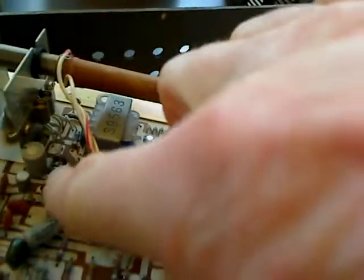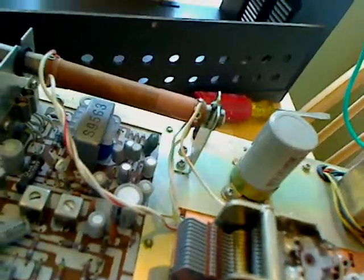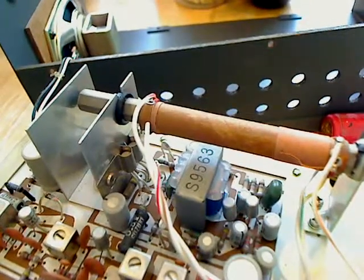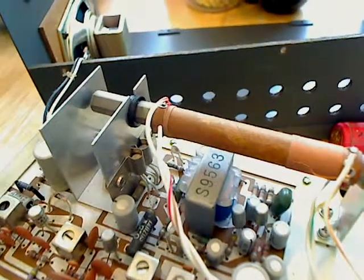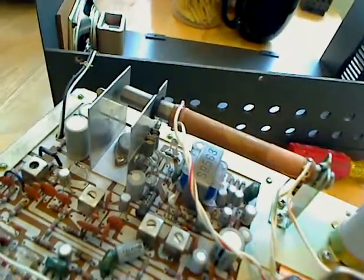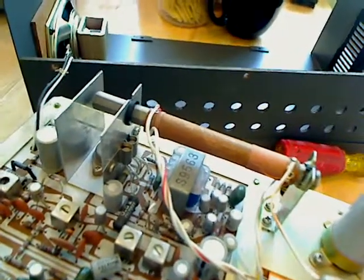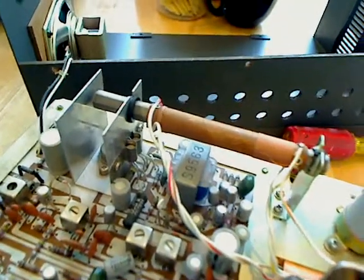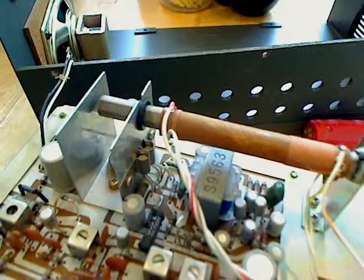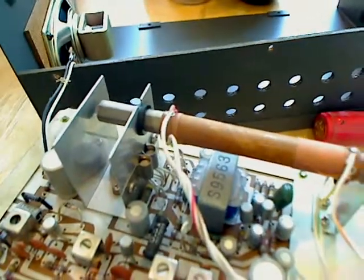It also has the AM band on it. But as far as what was wrong with the unit — if you look at episode number three, you'll see that I suspected the power resistor had gone bad, down in this particular area here. You can see the big 2-watt black metal-oxide resistor. I thought it looked a little darker banded in the middle, but in fact that tested good. The way I test my components is I actually lift one leg off the circuit board at a time to isolate them from the circuit and test them. That resistor tested good. When you're testing components, I really suggest you don't test them in the circuit — take the time to desolder one leg, lift it up and test it. Otherwise you don't really know what you're reading; you could be reading a whole circuit and your readings could be off.